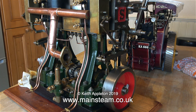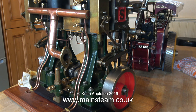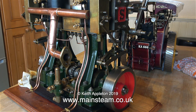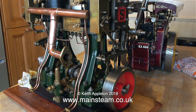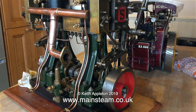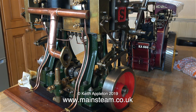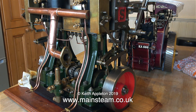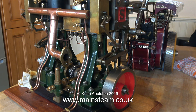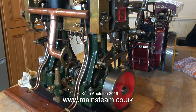I don't know anything about the history of this engine other than it was bought by my friend via eBay, and I don't think it's done much running — I really don't think this engine has ever been in a boat. Originally it was crudely mounted on some rough pieces of softwood, but now it's mounted on two solid oak bearers, which in turn are screwed to a mahogany plinth. The alignment of the two engines is fairly critical but not extremely so, because it uses a chain link drive in the center — the common chain around two sprockets allows for a little bit of tolerance.